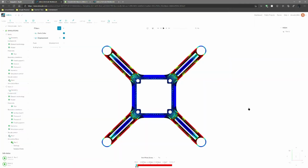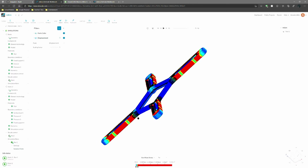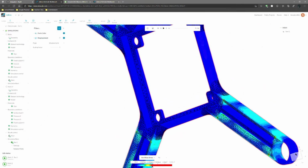We also extensively utilized static finite element analysis, or FEA, to simulate how the frame would respond to forces, allowing us to compensate for stress points, optimize frame weight, and build a stronger and lighter frame overall. The final product is an incredibly lightweight, simple frame that is not only easy to manufacture and build, it is also incredibly strong and micro-sized.